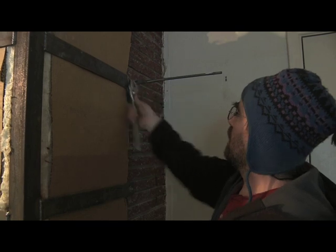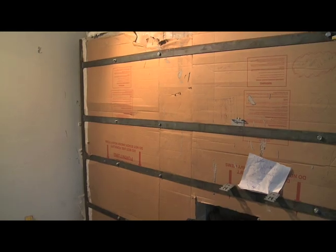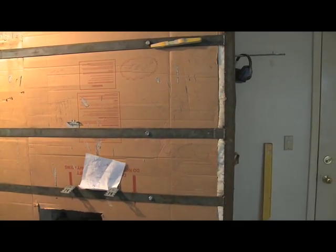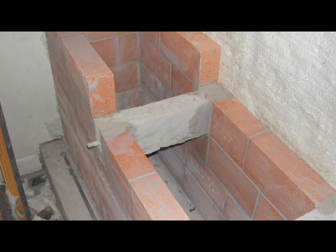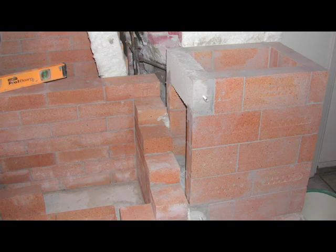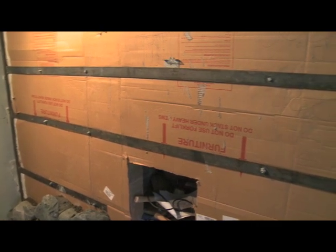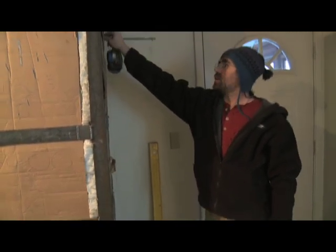We were able to continue our seismic reinforcing. And the way this works is, previously we showed the seismic ties. They were cast cross ties. So then we installed this framework, the steel framework, and it's actually on this side. It's tied back to the structure with redhead anchors, which are expansion anchors into the existing structure.